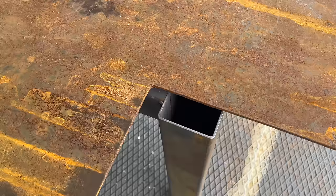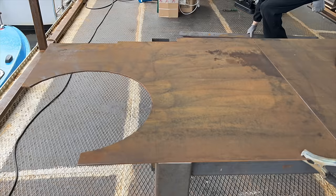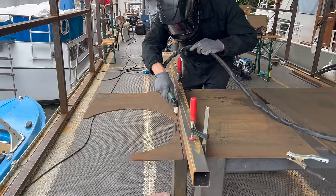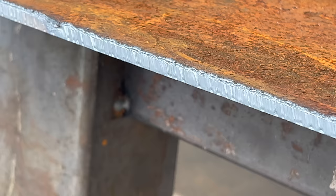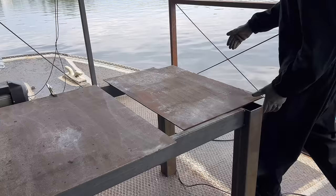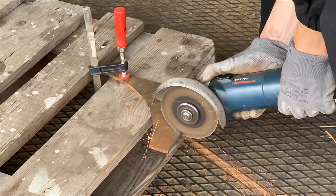The next plate that fits best is this one, and it fits almost entirely, except for one small square at the top right area. But before we do that, we first have to cut away the excess material on this plate. Here too we have a quick look at the cut, which looks good to me. And after cleaning the edges on this plate, we can focus on the little rectangle missing at the top. I simply place a larger part underneath it, trace the line for the cut, and then cut it out with the angle grinder.